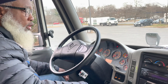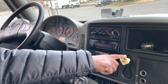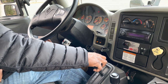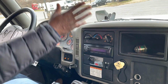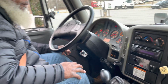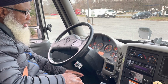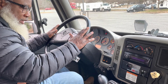The first test that I'm going to perform is the tug test. My parking brake, I'm going to tug against the parking brake by putting my vehicle in drive and tapping my accelerator. My brake should hold. Starting now. Put the vehicle in drive, tap the accelerator. I didn't go anywhere. My brake held. It properly worked. Put the vehicle back in neutral. Now, for my service brake, I would drive 5 miles an hour forward, apply the brake, and it should not pull to the left or pull to the right with no unusual feeling in my steering.